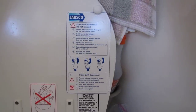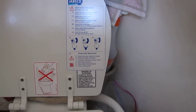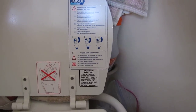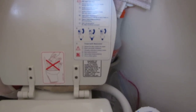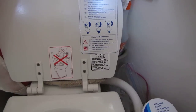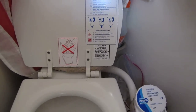I put the instructions right here. Instruction one says open your sea cocks. Section two says turn it to the right, which sucks whatever's in there out. Then you do number three, which is fill the bowl full. At that point you do your business. Then you do number four, which evacuates the toilet and sucks it away. Number five is you're supposed to close the seacock once again, but we leave it open.